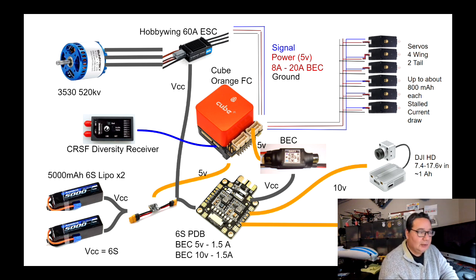And I'm thinking of doing that and showing you that during one of the build videos that we're going to do a little bit later on in this series. But just keep that in mind. The flight controller is able to grab power from the servo rail if necessary, but it will not provide power back to it. Okay, so that's one thing to keep in mind. I know a few people that have gotten confused by that, and it sounded a little strange, but that's one thing to keep in mind: with big SoC-based flight controllers, do not power the servo rail unless you specifically do something to power it, right? Some of them allow you to bridge it, some of them come with a little jumper, etc. But unless you do any of those things, the cube will not power the servo rail. So one of the things to keep in mind.